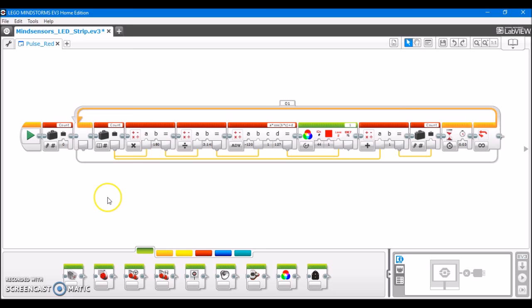Next, you're going to want to read this variable count and then multiply it by 180 and then divide by pi, which is 3.1415 and so on. The reason we do this is so we convert count from radians to degrees, because degrees is going to give us a smoother pulse because it is a smaller resolution as compared to radians.